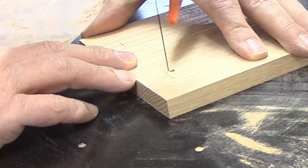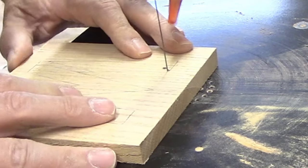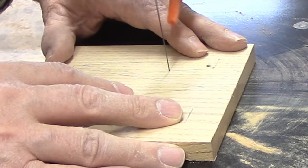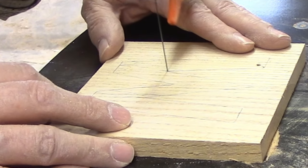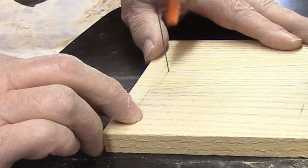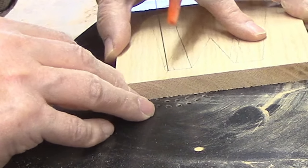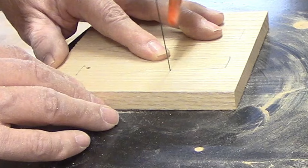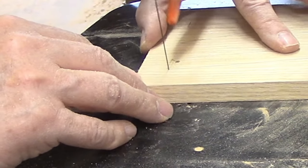When I was editing the section where I cut the letters 'Walk Me' into the bone, I noticed that because the letters were so small, it was not easy to see what I was doing. So I found a stencil kit for two inch high letters and used the letter W to trace the shape onto a piece of half inch thick oak — this makes it much easier to see how I went about cutting the letter. I drilled the pilot hole near one of the top corners of the W, then cut to the corner. When I arrived there, I backed the blade up slightly so it was no longer cutting, then pivoted the workpiece in the direction I wanted to cut next. I followed the long line down, but I did not try to make that very small angle because it would be difficult to get a sharp point. Instead, I kept cutting in the same direction as if that line had been extended all the way to the bottom of the letter. At the bottom, I was easily able to make the needed 90 degree turn, followed the short line, made another 90 degree turn, then cut up the vertical line for the left side of the W. At the top I made that turn, cut across the short line, and finished in the corner where I had started.